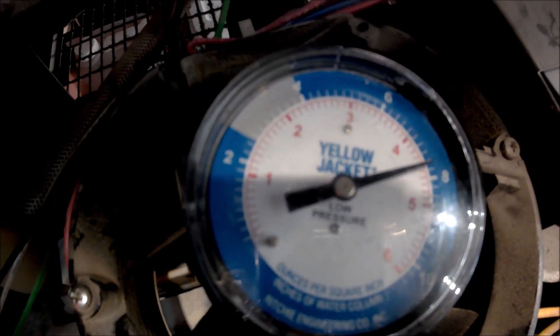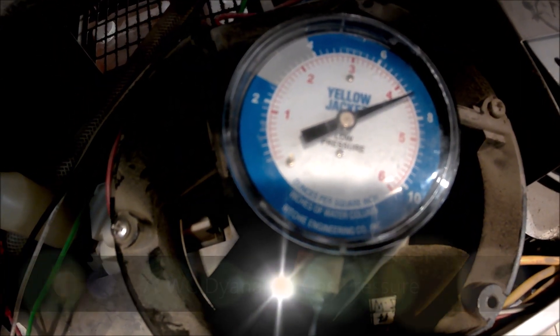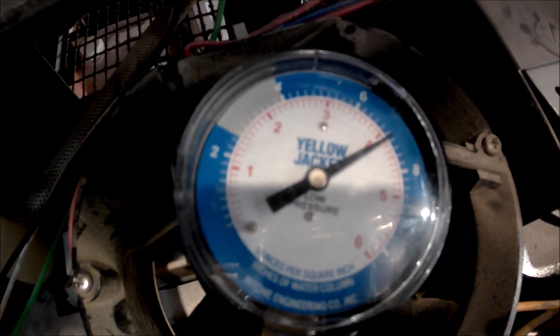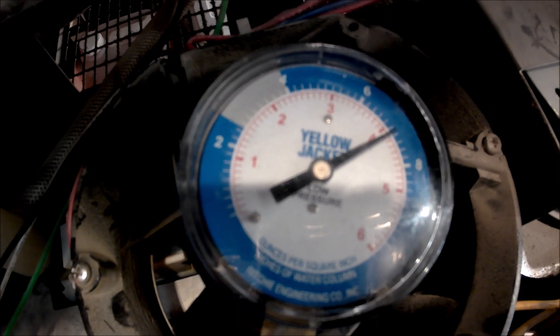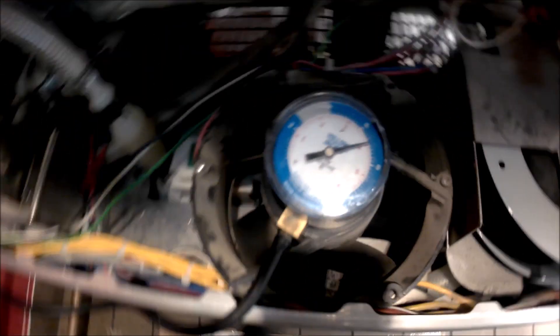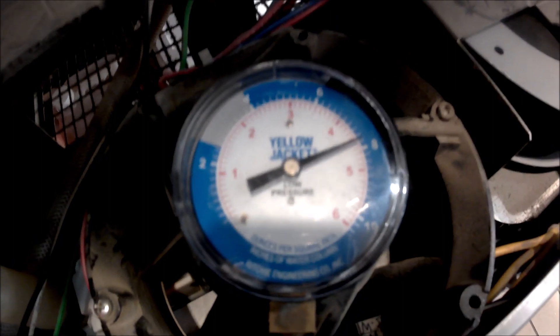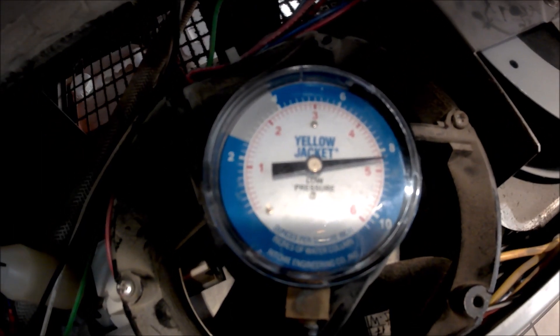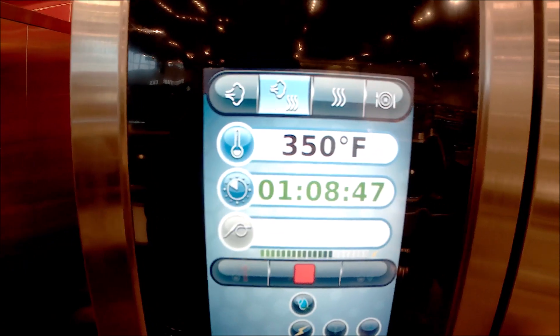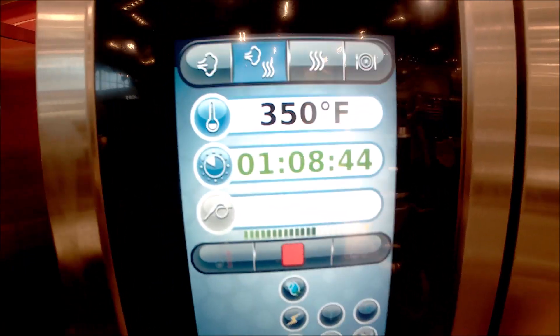What we're more interested in is the dynamic gas pressure. We have ignition — we're down to 7 inches water column, that's dynamic pressure, and it's holding. That tells me the igniter is working. We have about 20 to 25 seconds for flame sense, so let's see what happens. It's holding — and right there the gas valve just closed and we're back at 8.2 inches water column. That's telling me we're probably having issues with flame sense.